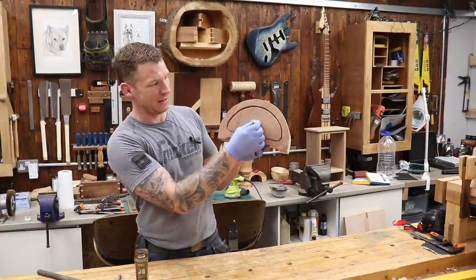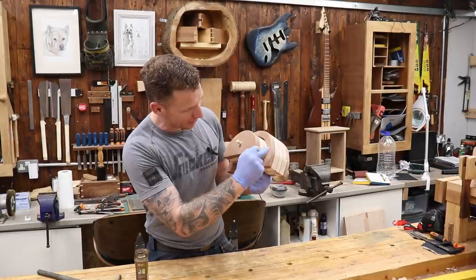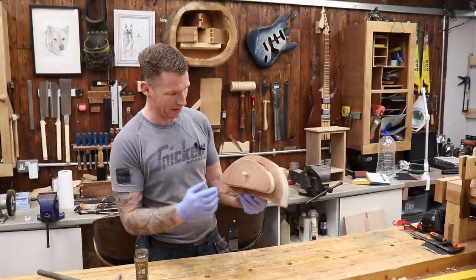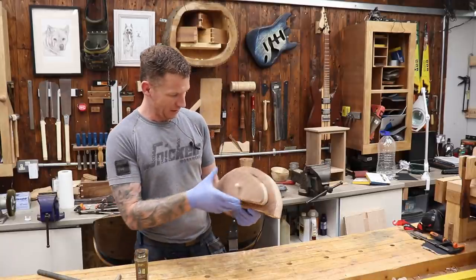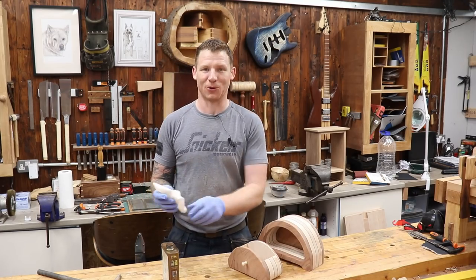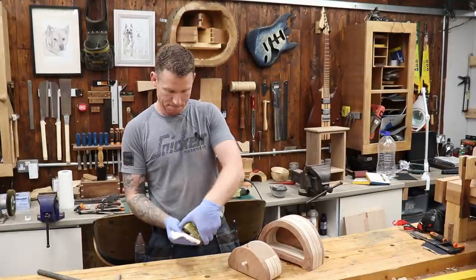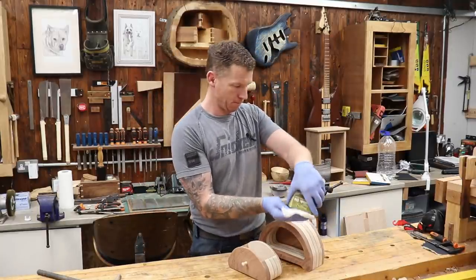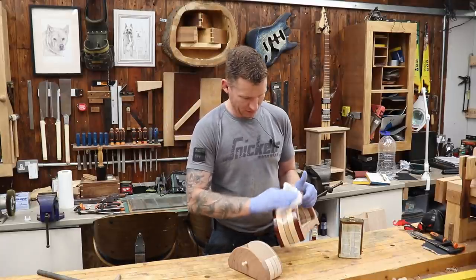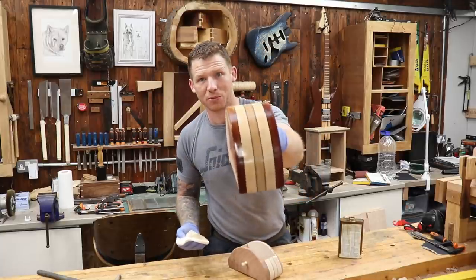We are all ready for the finish — the little handle is back on and the drawer is moving nicely. It actually looks quite well. You can't really see where the bandsaw blade cut into the box on the front because we followed the grain in. It's just a case of taking it apart now and getting some Danish oil on it — my favorite finish. I really have to try other finishes because I use this on almost every project, but it's nice and easy to use, a handy rub-on finish. Applying the oil is my favorite part of any project — it's when you can really see the project come alive, and that looks pretty nice.